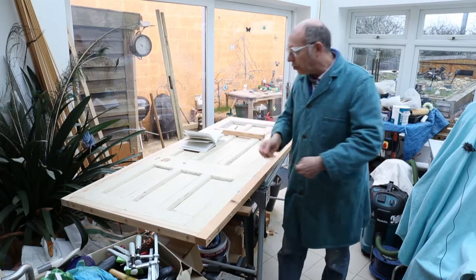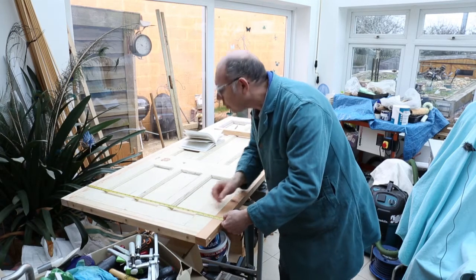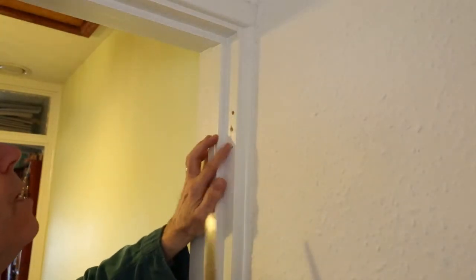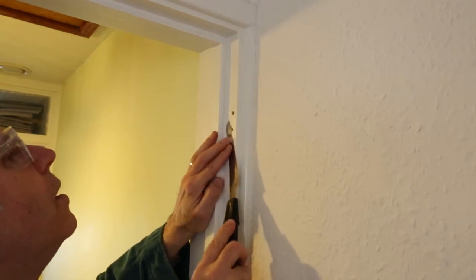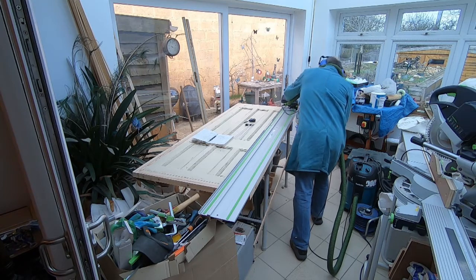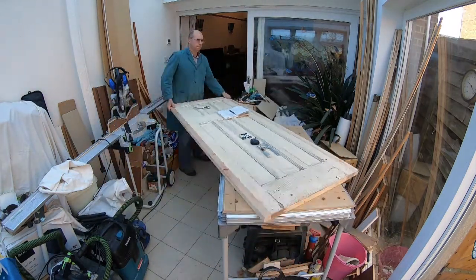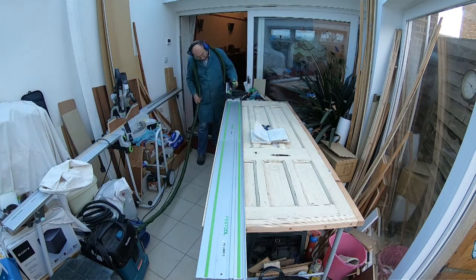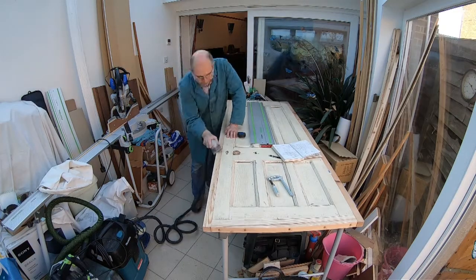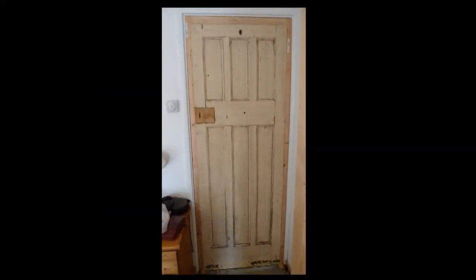Here I am talking about the width of the door — what a wonderful job keeping it all within one millimeter from top to bottom. The top face of the door is at 90 degrees to the side but the original lower face is at a slight angle; I will true that up before fitting. We're up in the bedroom now looking at the door frame. I've filled the original fixing holes for the hinges with wooden stakes, the glue has dried, and it's time to cut the stakes level with the surface of the paint using a small pull saw. I've taken measurements and now need to cut both sides of the door. I'm sanding the very straight, sharp edge the Festool TS-55 plunge saw riding on its guide rail has produced. John gives me a hand to carry the door upstairs and we drop it off in the bedroom, then slide it into the door frame holding it in place with wooden wedges.